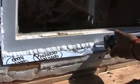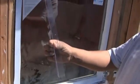Epi tools his sealant in such a way that we do not obstruct the paths of least resistance at the lower nail fins. This is where water will escape should it get trapped in our system. Now to terminate the inside of our pan, Epi is applying sealant all the way across the bottom of the window and six to eight inches up each side.